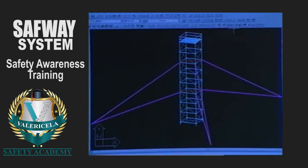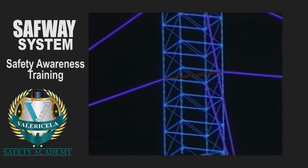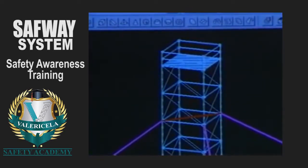Each leg of a single bay freestanding scaffold must also be guyed or restrained at the same vertical intervals as the run-type scaffolds. Horizontal diagonals must be installed at the points where the guy wires are attached to the vertical posts. However, an engineer who understands the forces involved should design guys and their anchorages.